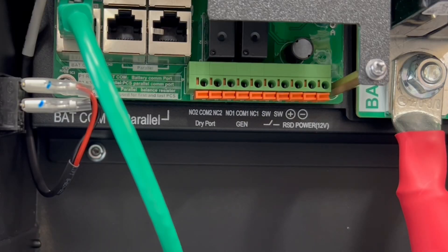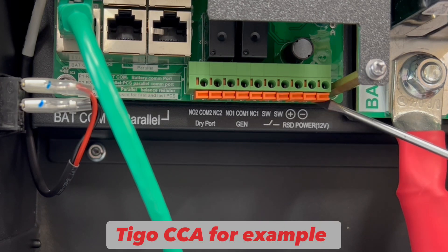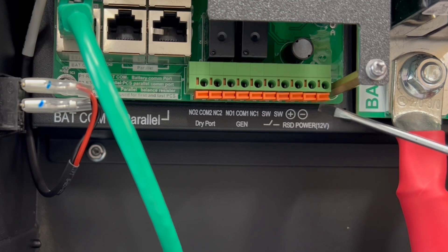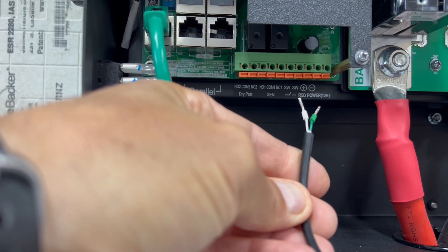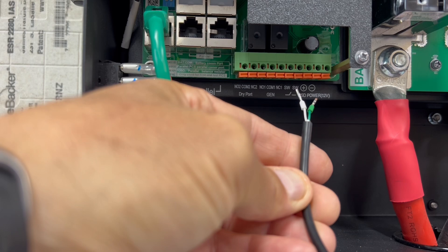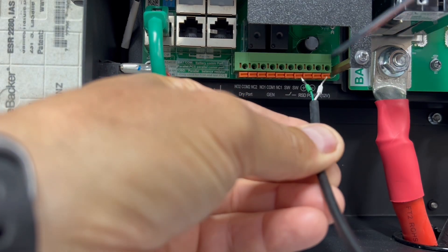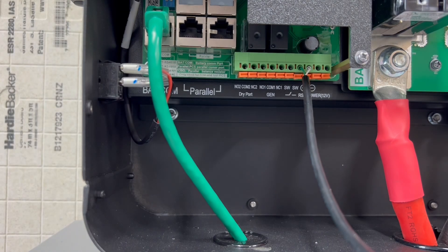As I mentioned, this can also shut down your solar panels. If you have solar optimizers on each panel, it requires a 12-volt power supply — you can see right here the 12-volt plus and minus terminals. But since I'm just wiring it in to shut the battery down, I'm not going to be using those. I'll be using these two terminals over here. Since I'm using a random two-conductor wire there's no specific polarity, so I'll put green on the left and white on the right.